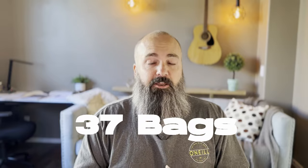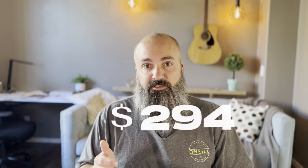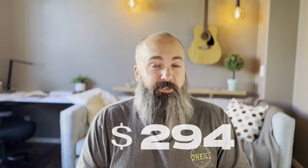Let's break down the insulation. I calculated originally about 27 bags for my wall fill using a bunch of different online calculators, all of which were wrong at the end of the day. I think that's because I actually got a good dense pack. I wound up with 37 bags for my 1,300 square foot garage — the two inside walls were pre-insulated since they're up against my house. I bought 30 bags originally at the bulk price of $2 discount when you buy 30 or more, so that was $469.51. The additional 16 bags were $294.60.